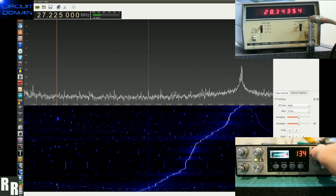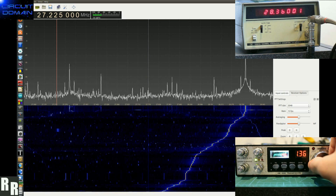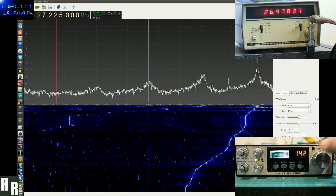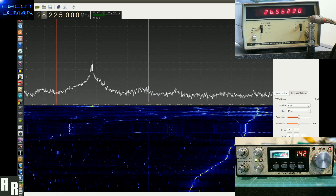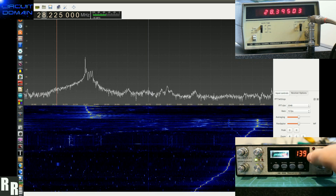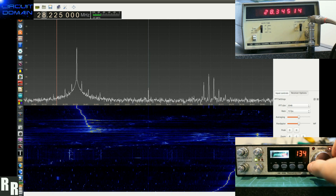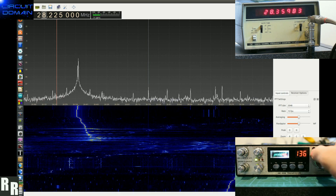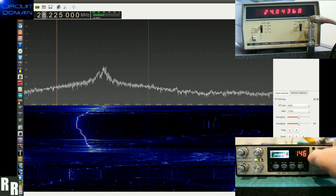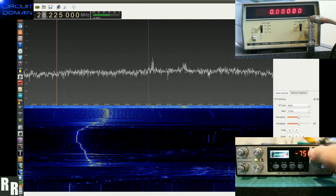Everything is rolling on nicely — just because we can adjust that 10.24 megahertz crystal. Now the frequency is starting to jitter a little bit, so we're starting to hit that upper limit. Around about channel 100 and 34 is about the max, then at 135 it starts jittering. So you can just see that it does truly work all the way — pretty much across most of the channels. That's really good reach when you're talking about just a little AX144.